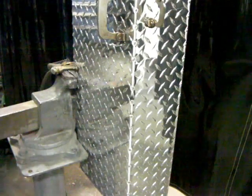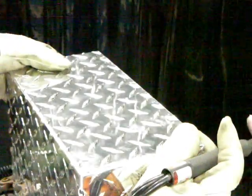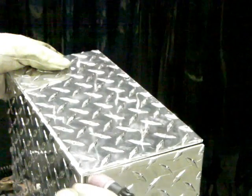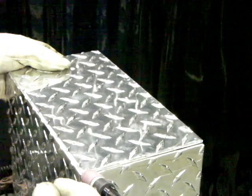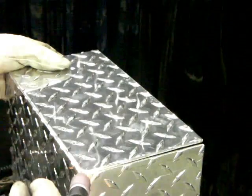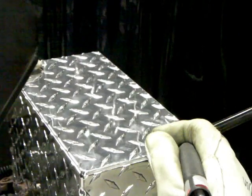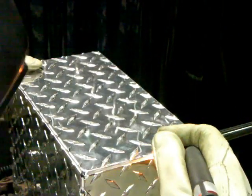On a tank like this, once you get a good 90-degree angle with your first piece, it just goes together from there. Just make sure to line the corners up — inside corner to inside corner, don't overlap them. It's best if you have a corner-to-corner type joint and do an outside corner joint; everything melts together a little bit better that way.